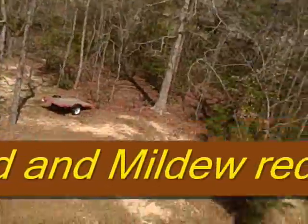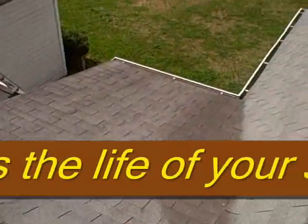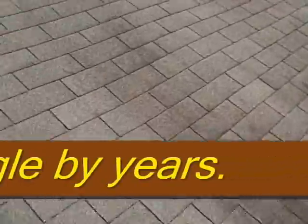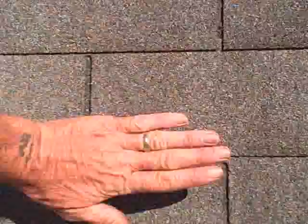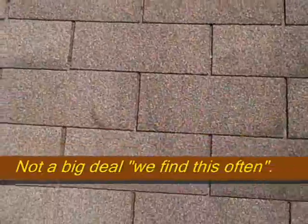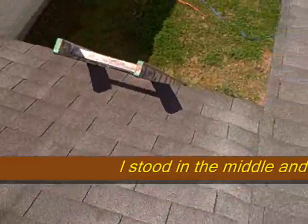The other backside can also be washed — it's very dirty, but not a big deal. The shingles are in great shape. The only issue is you have a sag right here in the middle of the roof. What's happened is there's a rafter here and a rafter here with a big open space — they either forgot to put a rafter in or something in the attic is broken. That's not even a problem.